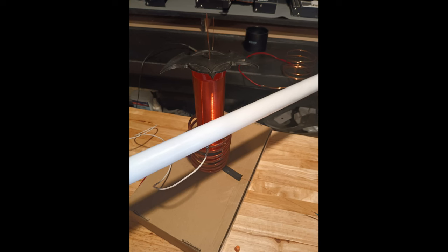So what's happened? You're getting feedback into your number one coil. It's just not resonating, not the way it needs to. So you're going to get a hum sound that comes out of your number one coil. That should never be there. That is a big no-no in the building of this Tesla coil. I'm surprised I didn't have a worse result or blow something out because of this. But that's one of the pitfalls you're going to run into when you start building things like this.